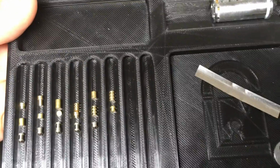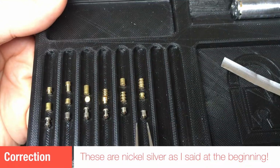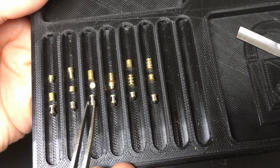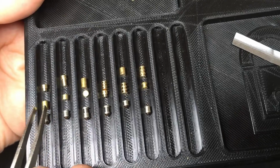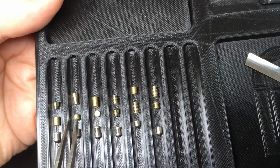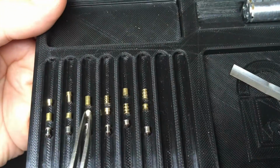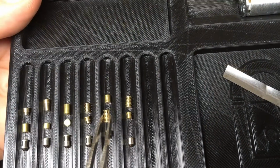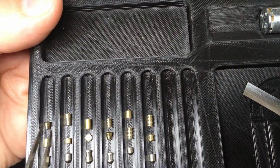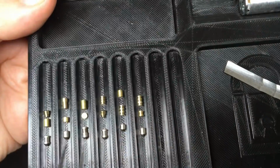Oh, they're escaping. So first of all, it looks like all of the key pins are steel, so for their anti-drill properties. So look at these, and they have spooled key pins. So if you overset them, they'll end up acting like spools. Then the sort of, let's call them the wafers, even though they're not, that act like the center shear line, are a mixture of standard pins, T-pins, serrated pins, well, spools, I guess, multiple spools and single spools. And then you've got T-pins again, standard pins, multi-spools, and standard pins again at the top.